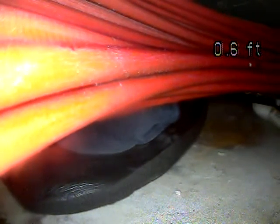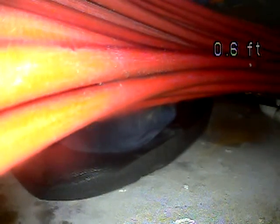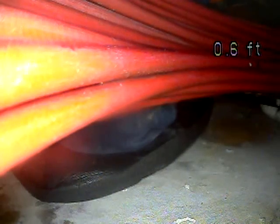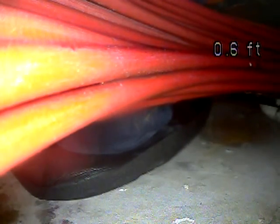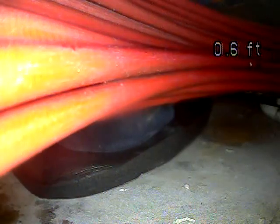Had I not seen that, I would say it looks like a pretty typical line performing the way it should. But with it holding water in the beginning of my video, that was a blockage. It's kind of a blessing that you got a scope because I was able to break through that without it backing up into the house. But it does show what can happen in the future with that little piece of cast iron. I'm going to end this recording now. Bye.